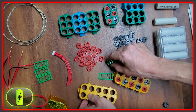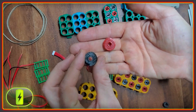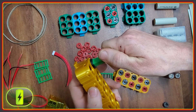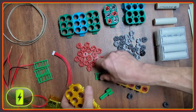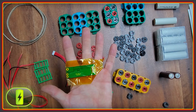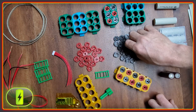If we look at a screw, you can see a raised circle. This is the pressure point that, when tightened with this tool, compresses the braid onto the positive or negative contact. The battery is not pushed apart when the screws are tightened because of the clips on the side. There is also a little BMS for this pack, and that will get wired in and will keep everything balanced. There's going to be a lot more information on how this particular part works in practice when I get to building these packs.